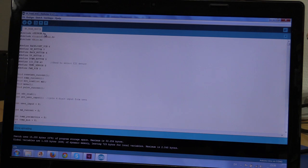The EEPROM.h to save to the EEPROM, the LiquidCrystal.h for the library to the LCD display, the Wire.h is for the I²C communication to the DAC and the ADC. I have defined a whole bunch of pins here. PWM for the backlight is pin 6, all the buttons, and this I²C pin, A3,